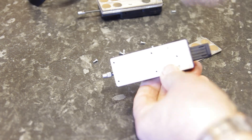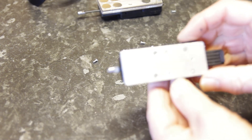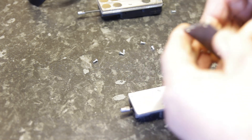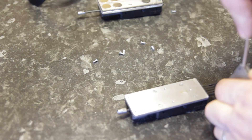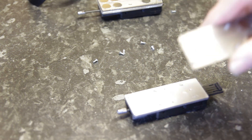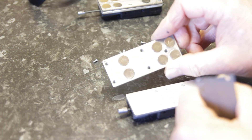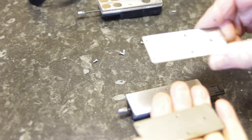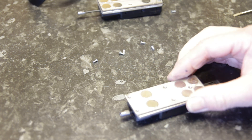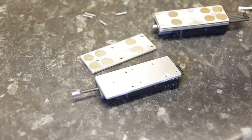Putting the screws back in again — so we have the aluminium base, then this steel base plate. It's just a thin piece of steel stock I had. The magnets are 12 by 2 millimetre; I drilled a 12 millimetre hole in the base, reamed it out, and they just fitted perfectly. The steel plate fits between the two and forms a nice magnetic block, which is then screwed back on. On my particular lathe I intend to make a little angle plate as it'll be easier to mount, and I'm going to order some more magnets.